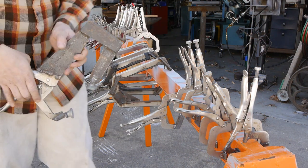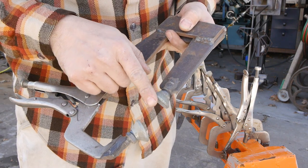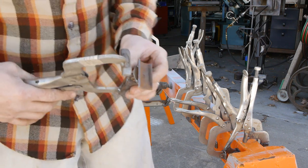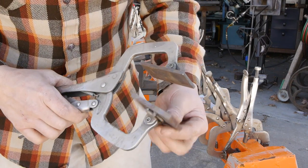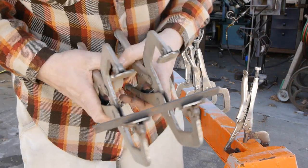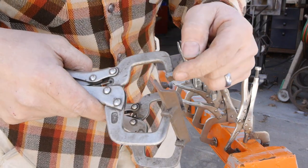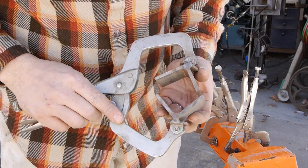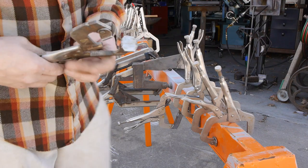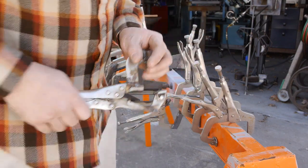Let's get back into the modified clamps. Some of these are self-explanatory — there's nothing fancy about them. The pads on these are machine leveling mounts; they work really well. This one I made for dimpling tubing on a bicycle — the tube is called a chainstay, and that was done while the metal was hot. These clamps are great for aligning flat material like sheet or square tubing. These clamps come in handy for butt welding round rod or round tubing together. I have another set with a notch cut into it for a specific task, and this one I've used to align two pieces of pipe for butt welding. And this little ugly duckling is a locking seat clamp that I made using pliers — the shape of these jaws allowed me to clamp onto plate that was submerged under cutting fluid.